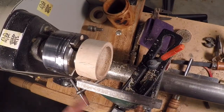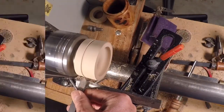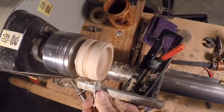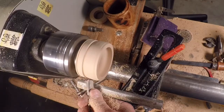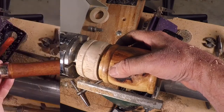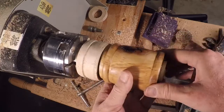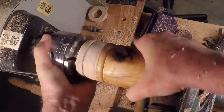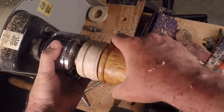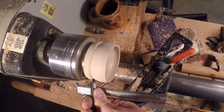I've got the lid mounted and addressed the runout, so it's nice and round. I'll lay out about where I want the bead, and I want this to be a little bit of a barrel shape turning into the bead. We'll do a trial fit with the base, then cut the register from the top to the bottom. Pretty good - it's tight, and if I'm careful when I sand it should give me a really nice register. I'll get the bead shaped and apply some linseed on the underside.